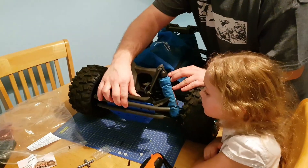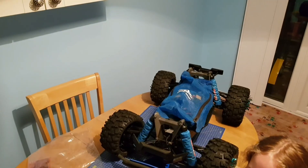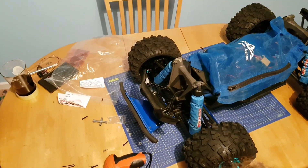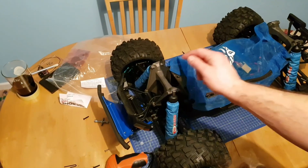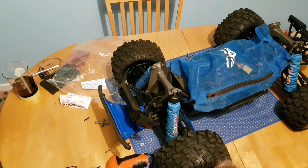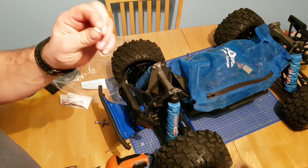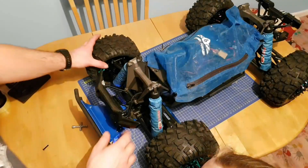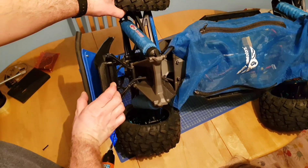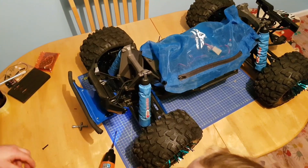Now I'm going to turn this over. One thing that's probably going to be quite hard to see on camera, so I'll move the angle so you can see exactly what's going on. Now we've got the top part and the original part that roughly come together. We're going to drop two M4 by 18s down in there. They also give you little nylon bushings that you can put in, though I've personally found from previous experience that they don't work very well.